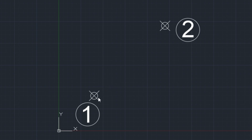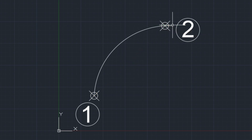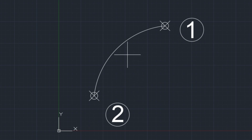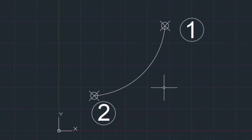I've created two points on the card. I marked this one as point number one and this as point number two — this is very important because it orientates your arc. The arc is going to be created like this: point one is first and point two is second, and the arc will be on the left hand side from point one towards point two. Once you swap them — point two becomes first and point one becomes second — the arc goes the other way around. You can imagine now how important it is to orientate your arc correctly, as a mistake on a long arc of a few hundred meters with a very big radius can cause big problems.